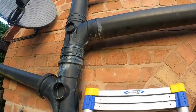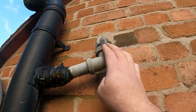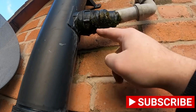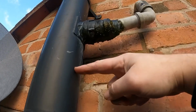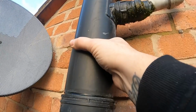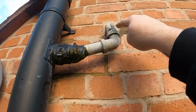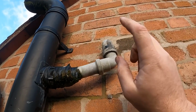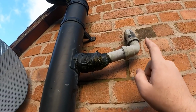It's basically, this is a waste pipe coming from the sink inside. So obviously coming into this boss that's been leaking for years or whatever. So what I'm going to do, I'm going to completely take this out, cut a new boss in here, strap it on, cap this boss off, work back up using the original hole, go through and then connect upstairs at the back of the basin onto the existing pipework. So I'll take you upstairs in a moment and show you where the basin is that's feeding this.